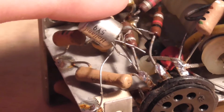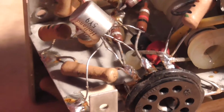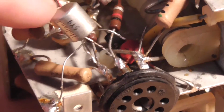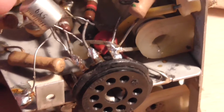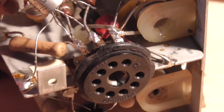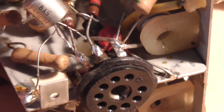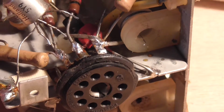Right, okay, we've managed to unsolder three of the leads, as you can see there. I've got it hanging by one lead. Luckily, it was tagged on and the wires were not wrapped around, which is very handy. And I'm hoping the transistor on the other side will be the same. So we'll test the transistor, and then we will start looking at these resistors in here. So that's the next bit. Okie dokie.